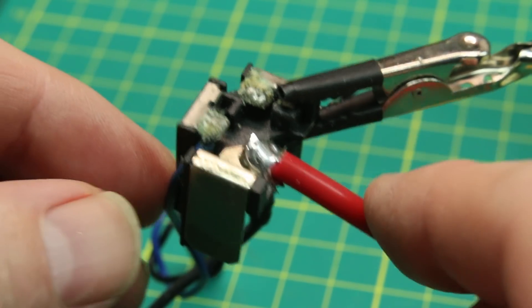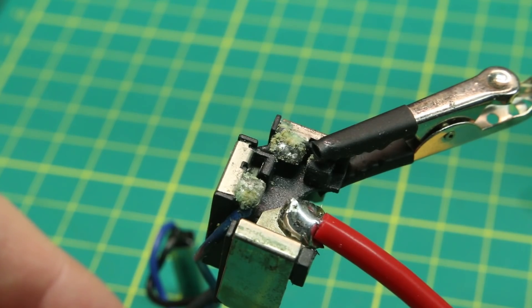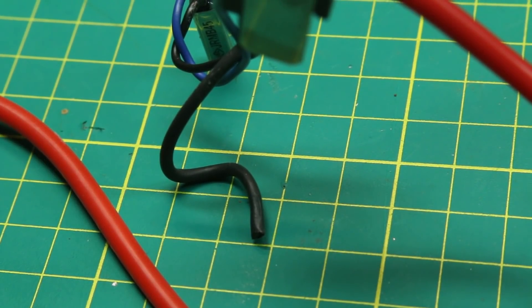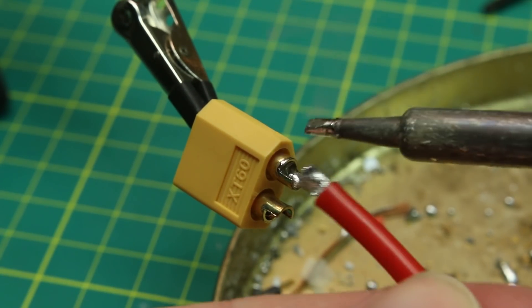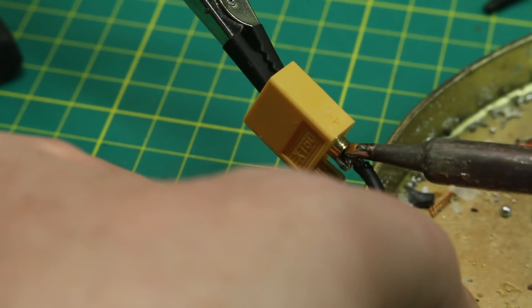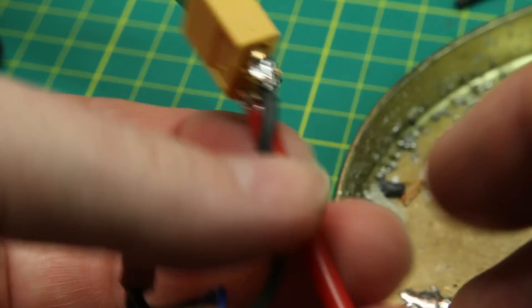As long as that will fit up through and bend still. Can't bend it because there's still plastic underneath there — we may distort it, but that's what we need. And we'll reuse our negative here just for kicks. We will reuse this really crappy negative wire, but it's plenty good enough for this — crappy in comparison to this nice silicone, but that'll do the job. Then we'll solder it to this XT60 and we're good to go. The negative wasn't the best — better to not reuse that wire, there's a lot of contamination in there. I've cleaned it up but it could be better. But this should do the trick.